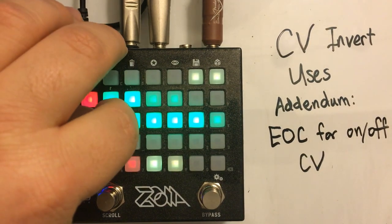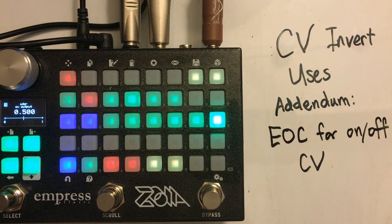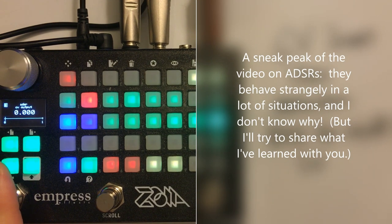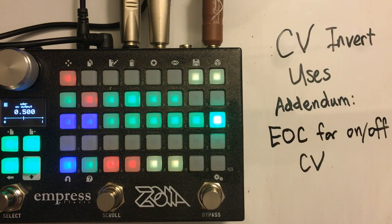It can trigger an ADSR. I found something interesting while preparing for this video: when we use it in this method, the ADSR stays open. No matter what settings I've set it to, it won't close until you press the stomp switch again and it goes back to negative one at its input. This is potentially really buggy behavior, but it's also one we can exploit in some interesting ways. I'm going to take a quick break, patch something up, and show you what I mean.